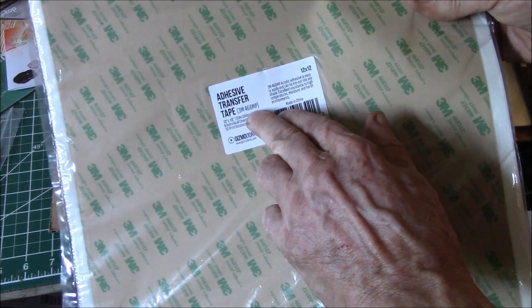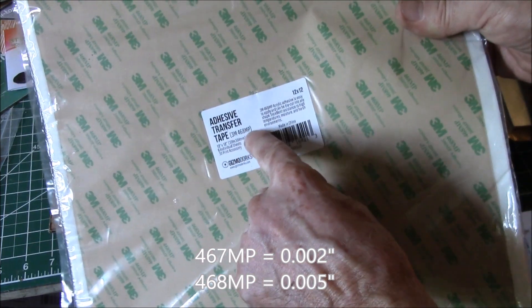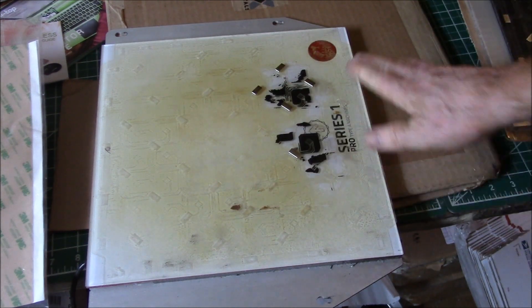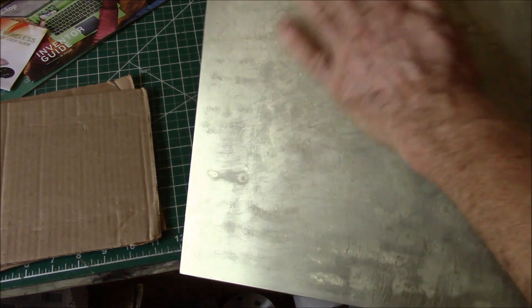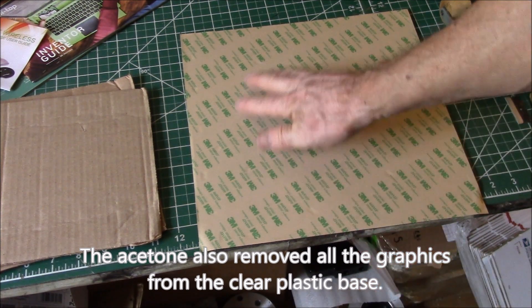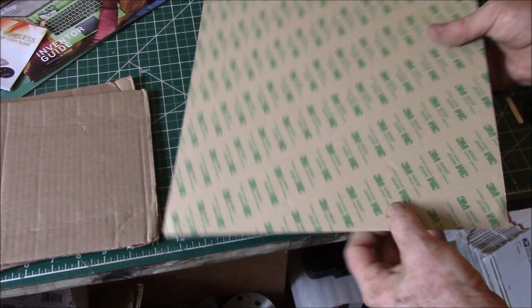Build Tack is working on a slightly better adhesive. What they currently use is 3M 468 MP — or there's also a 467 MP. The 468 is a thicker adhesive and a little easier to find. This is what they recommended: a sheet of metal, new adhesive, clean it off and replace it. I used acetone to remove all the adhesive residue and checked all the magnets to make sure they were all below the surface.